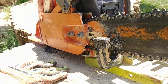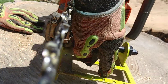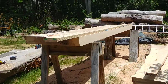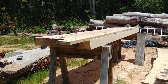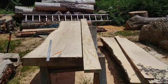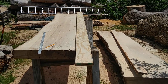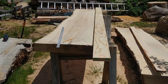So, yeah, that's it. And also, it comes with a fence that goes in here that you can mount in here. So if you want to use a 2x4 instead of a 2x6, or what I've found is the 2x6s get beat up and they twist and they're not true enough. So I decided to make this setup with the plywood. And I can go out with just one sheet of plywood. I got a 32-foot straight edge to cut. I can cut beams up to 32 feet long.